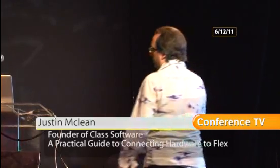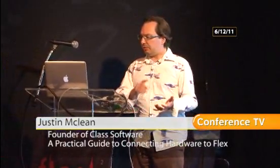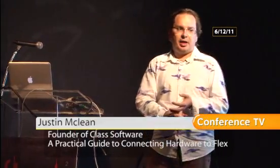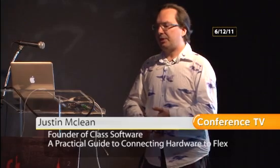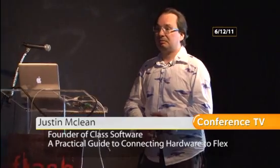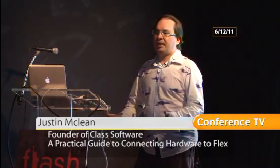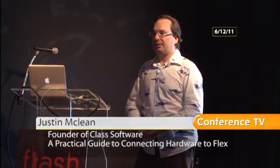There's about 20, probably 30 odd Arduino boards out there. They're pretty easy to program. As I said before, you code in C. They're fast. They run at 16 megahertz. Now, that might not sound too fast, but they're a RISC processor, and they can do 16 million instructions per second. For most purposes, that's really quick. You're not going to do full screen video with that. It's not designed to do that, but almost any number crunching you can think of, it's going to be able to achieve.